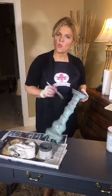You can remove the weathered wood to your liking with a damp rag. Even if you want to take more off, you could totally remove it. You can take it right back down to the paint. It doesn't wet distress. So even if this were a damp rag, when that paint's cured, you cannot wet distress and you won't remove paint. Even if I had a damp rag and go in here and try to remove this, this has been painted for a few days. There's nothing going to take that off.